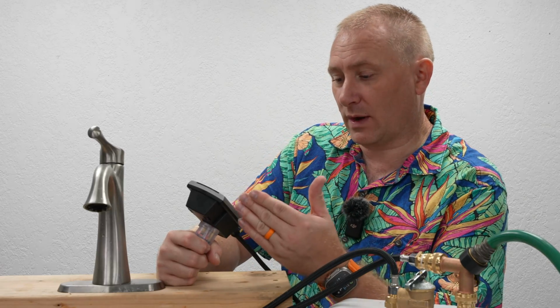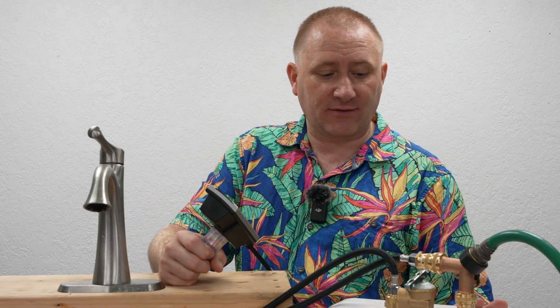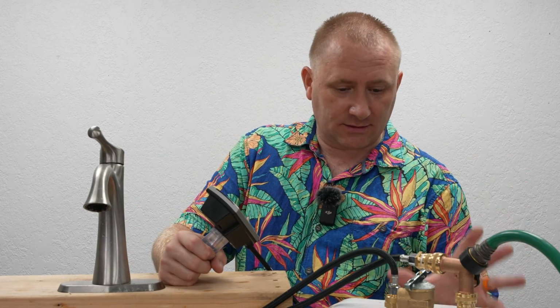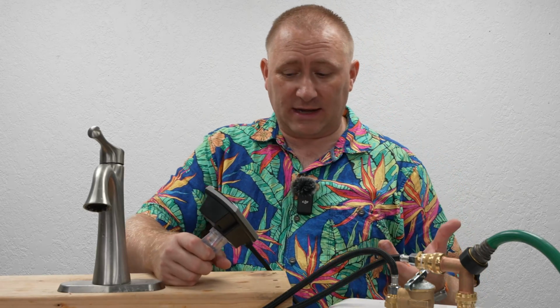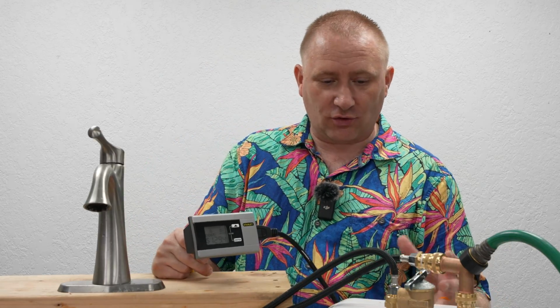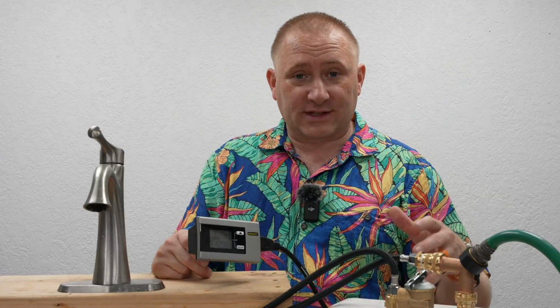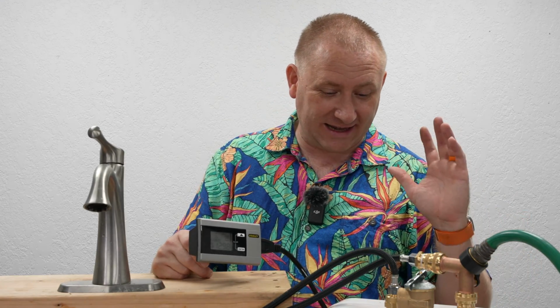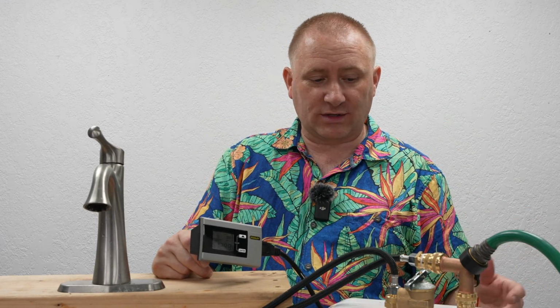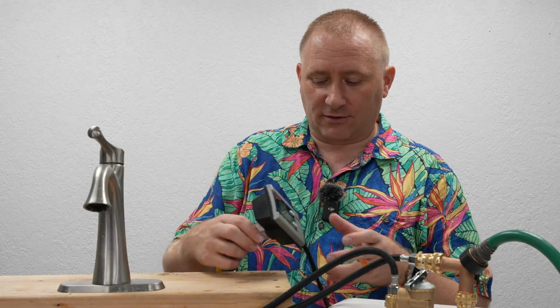The other thing this will tell you is how many watts or kilowatts you're using. Right now we're at 1.5 kilowatts, so 1500 watts. That's the heater source in here that's drawing that 12.5 amps, a 1500 watt heating element. The amount per month means nothing, because it's the same thing if you plugged it into about anything. While you're running at peak heating, it's going to cost money, but once you're off of that, it's feathering to keep it hot. It's not going to be that crazy.